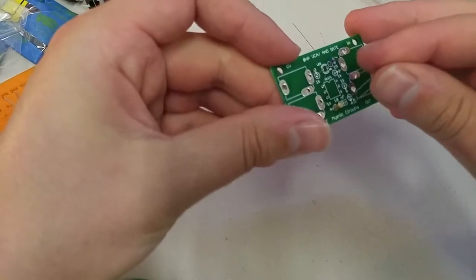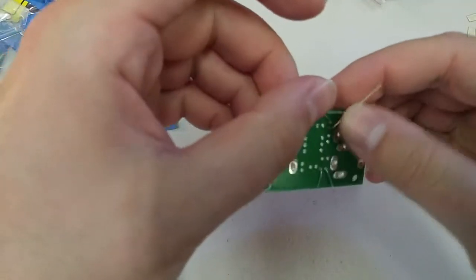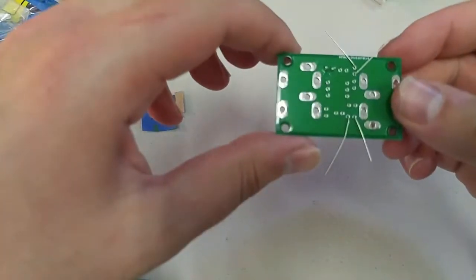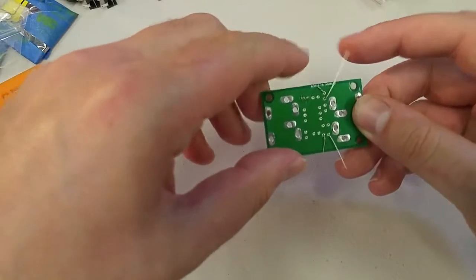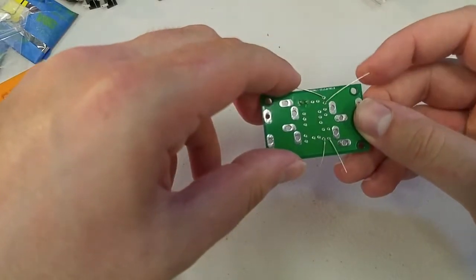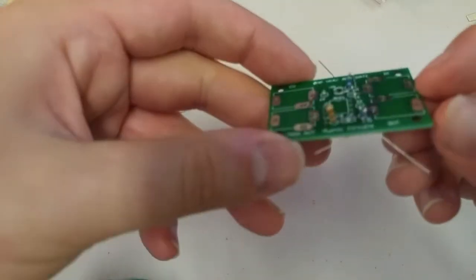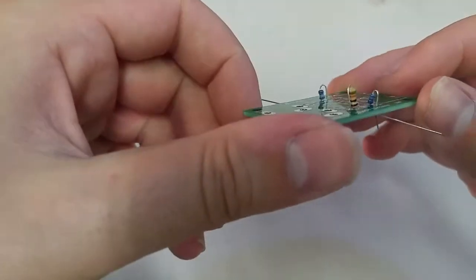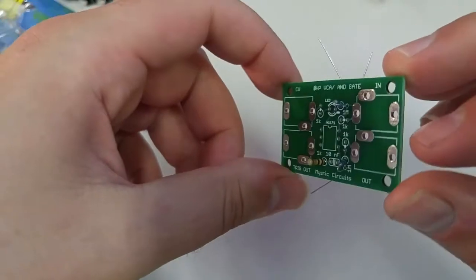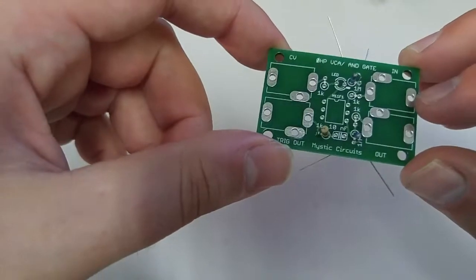If you don't feel confident about this, you can of course do 1 resistor at a time, but if you're following along at home, 2 resistors, it's not super complicated. So we've got the legs. I did this fancy V shape to keep the legs all away from the other holes. Just before committing to this, you can see kind of where the resistors are. Again, they're next to the 1M symbol.